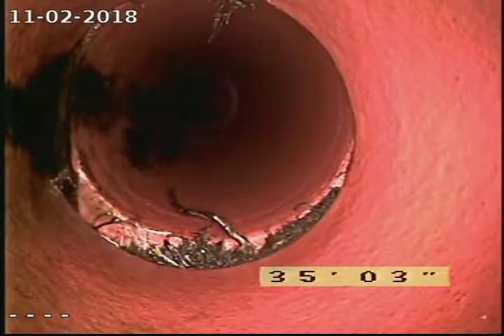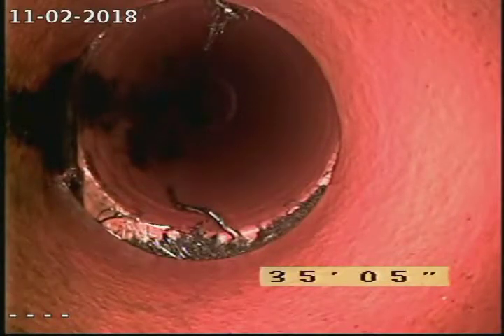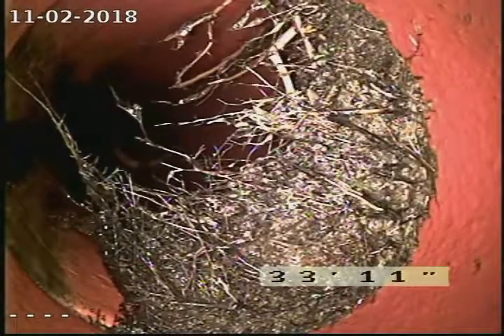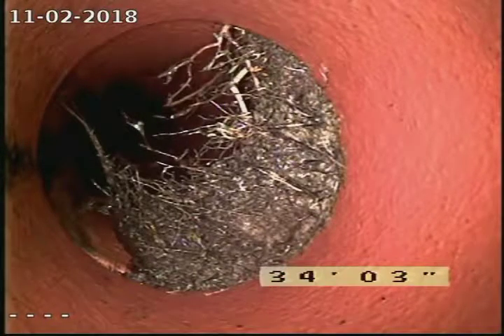Slight offsetting at about 36 and a half feet, roots growing through the pipe. As you can see, water is washing out underneath there, which will cause a void and cause the pipe to drop. At 33 to 34 feet we've got another major root mass inside there.